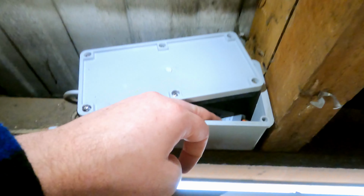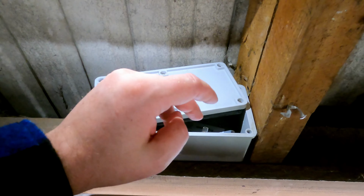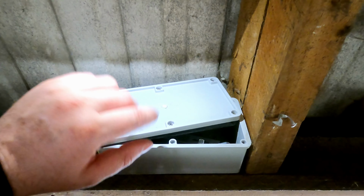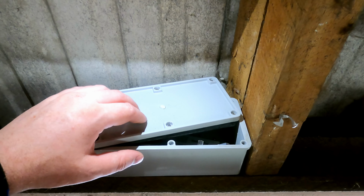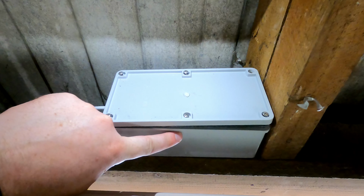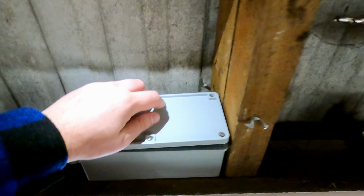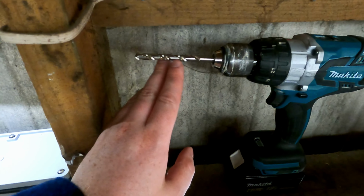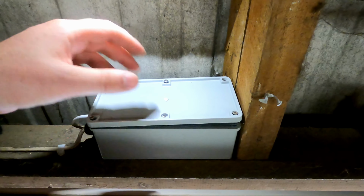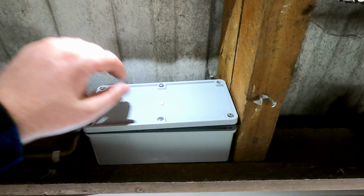Make sure that you move the cables right out of the way if you're going to be drilling extra holes once the driver and cables have already been installed. Now when you're drilling these holes, just remember it does affect the IP rating of these boxes, so dust and water can also get in. When drilling holes, you want to balance it, so you put 3 on this side and 3 on this side. Use a small drill bit, 8mm max, because otherwise you're going to get some debris and other things entering. With smaller holes, you can only get small insects or dust coming into it.